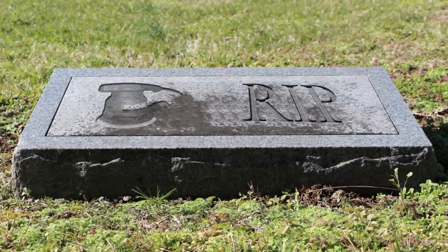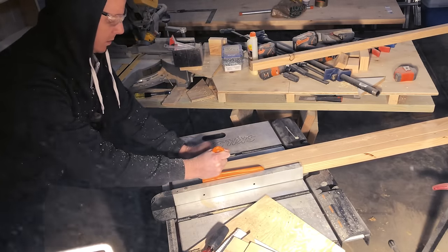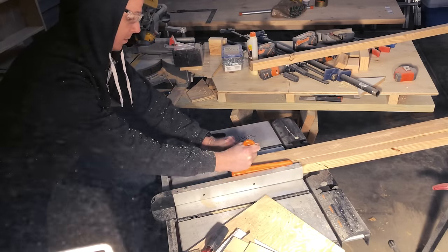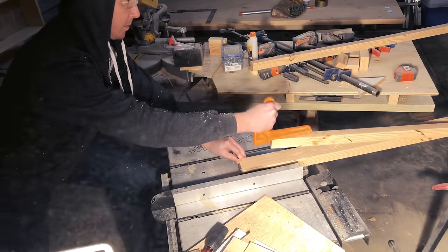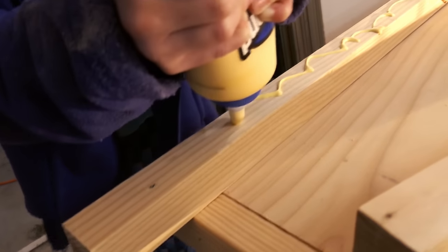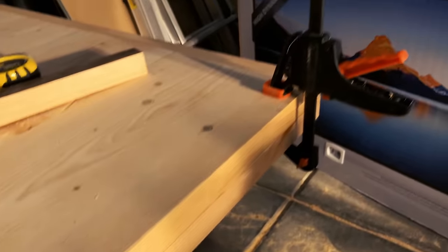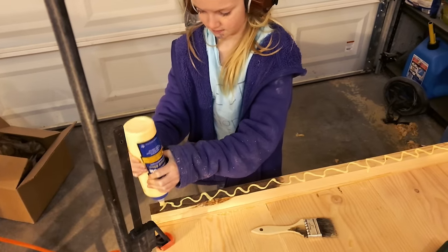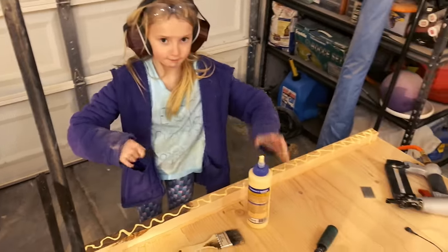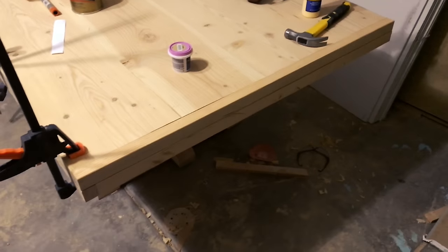Before I got too carried away with sanding and planing, I thought it was time to put the skirts on and then the 2x4 end caps. Remember on both of these you do want to remove the rounded edges that typically come on any 2x4's or 2-by-anything. Once I had those cut, I placed them on the table, used some wood glue, and then used brad nails to hold them in place. You probably don't have clamps that are six, eight, or ten feet long for such a long table, so what you can do is once you have the skirts in place, put the end caps on and then use a ratcheting strap — the same kind you'd use for cargo on the back of a truck — and strap those down to hold it in place while the glue dries.